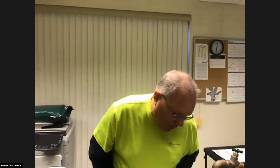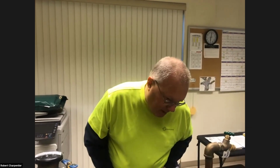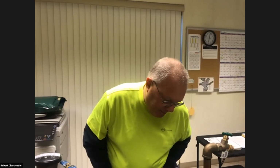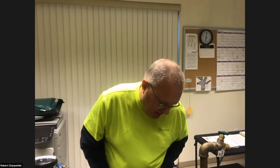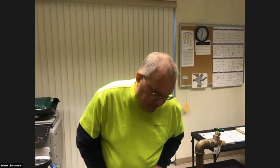Okay. Well, you know, a lot of times the water pressure in the water system can be much more than that. But if it's set 20, I set mine for no more than about 70 PSI. Kind of a small tank, and it's a little bit painful to go through it. But, you know, I think when you start getting up over 60, 70 PSI, you're really asking for trouble. And then if you get down too low, you may have a tough time getting a lot of that water out of there. So you want to do what's comfortable for your system.